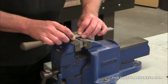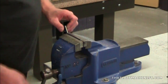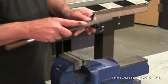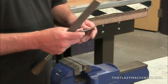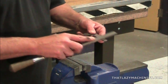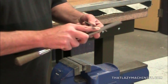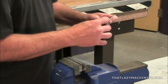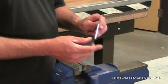Once the surface is finished, I can remove the part from the vise, and using a very fine-tooth file, deburr the edges of the surface that I've just produced. I didn't deburr it beforehand, because I would have erased those lines that I was following. So deburr only once the surface is finished. That surface is complete — it's nice and straight, nice and flat, with a nice, fine, constant surface finish.